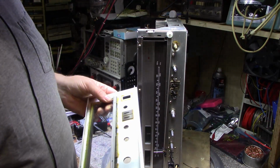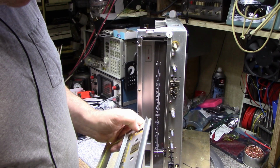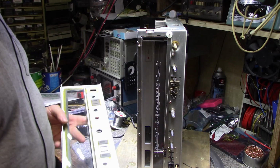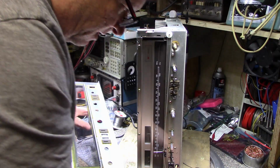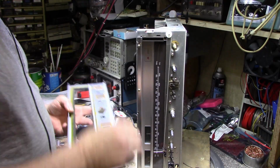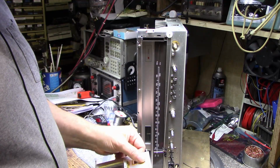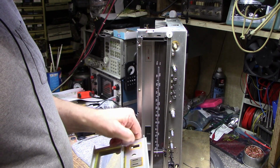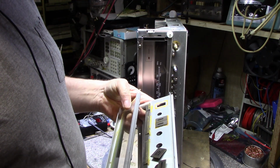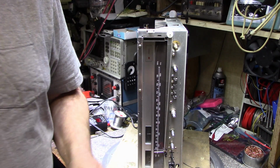Well, part of the problem is this yellow glue that they use. It just kind of deteriorates into a crystalline mess. But yeah, we can fix all this up. This is minor stuff. So all these come off, and then they get glued back on. And I'll probably use a little bit of epoxy to rebond this back to the aluminum. Get rid of all this other glue, and just re-epoxy it, and then it'll never come apart again. After it's all cleaned, of course.